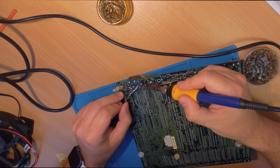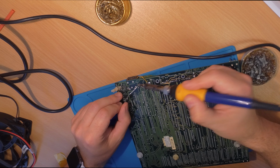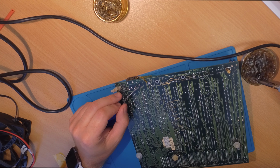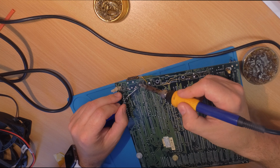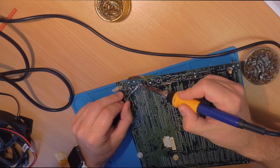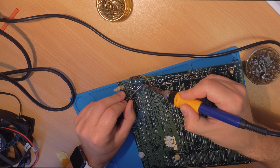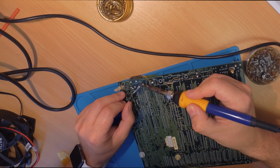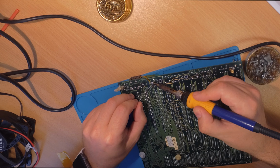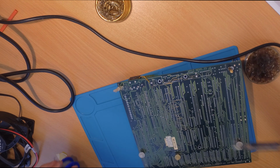in the other way. But each diode has a voltage drop, and since that is requiring 6 volts and a diode will give you another 1 volt voltage drop, you will have something like 4.8 volts. I'm not sure if that's enough. Maybe it is. I guess it's something you could explore, but I don't think you can get away with just soldering the battery without the diode.